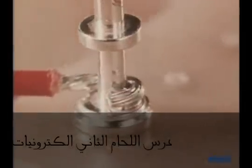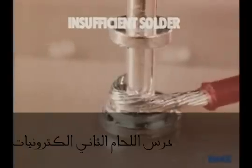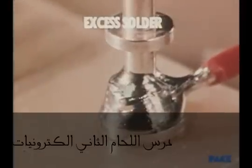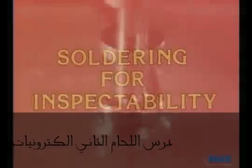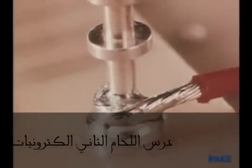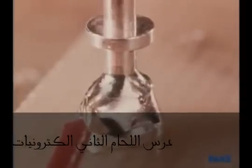This joint is unacceptable because there's too little solder. The joint may otherwise look good, but there's too little solder on it for acceptable mechanical strength. Also unacceptable is the joint with excess solder. The fillets here are convex, not concave, and the outline of the wire has been hidden in a mound of solder. Soldering for inspectability is a basic rule to follow — it means soldering so that when you're finished, you're still able to see the outline of the individual strands of wire in the joint. This joint has been soldered for inspectability. In this case, there's too much solder on the joint — the outline is gone, and the true condition of the joint cannot be determined.